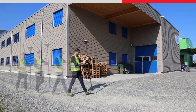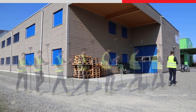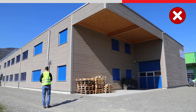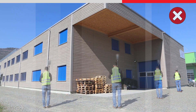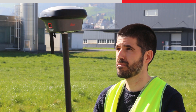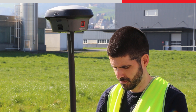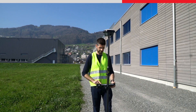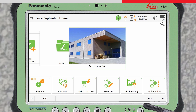To capture images of the obstructed area, it is simply needed to walk alongside the area to be measured whilst holding the RTK rover. There is no need to stop to take photographs from fixed point positions like when using similar technologies. To use the GS18i to capture images, the sensor must first be orientated so that the camera points towards either the left or right side, facing the area you want to capture.